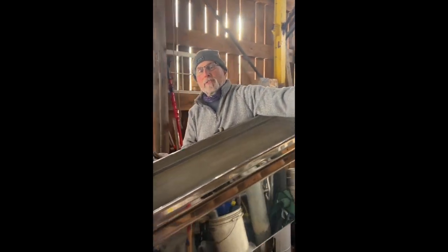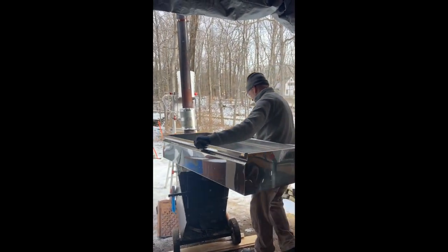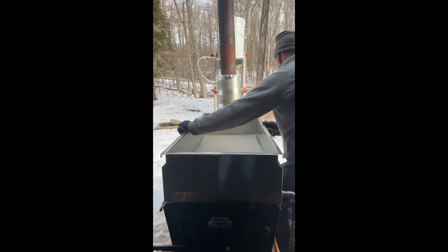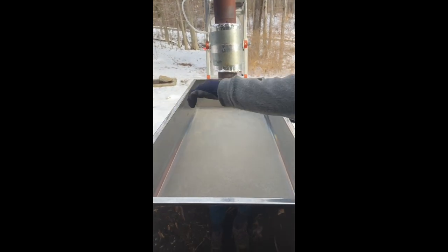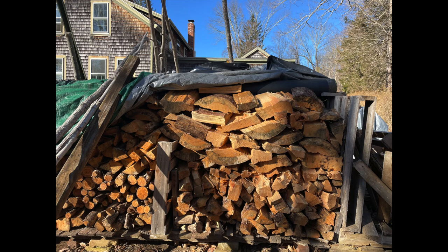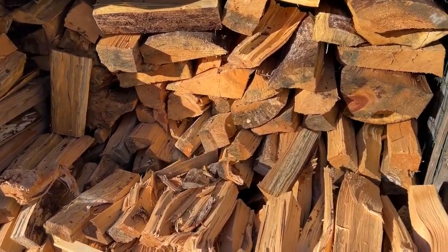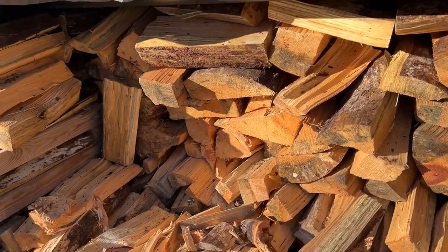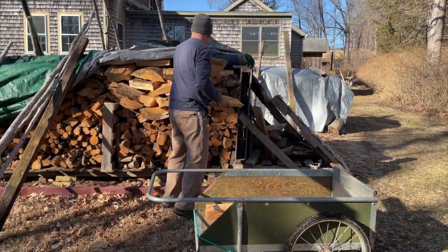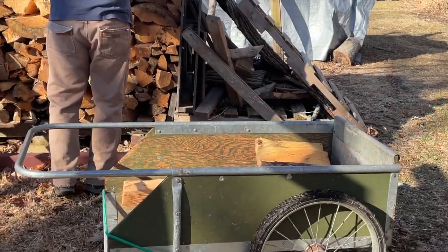We're setting up our Smoky Lake flat pan for the last boil of the year. For a unit this size, dry pine is absolutely the best. This gap here — this is what one boil is for us: 40 gallons. We use that one level right there, basically three wheelbarrows full for each 40 gallons, plus or minus. It depends on the temperature outside, the wind, and a couple of other factors.